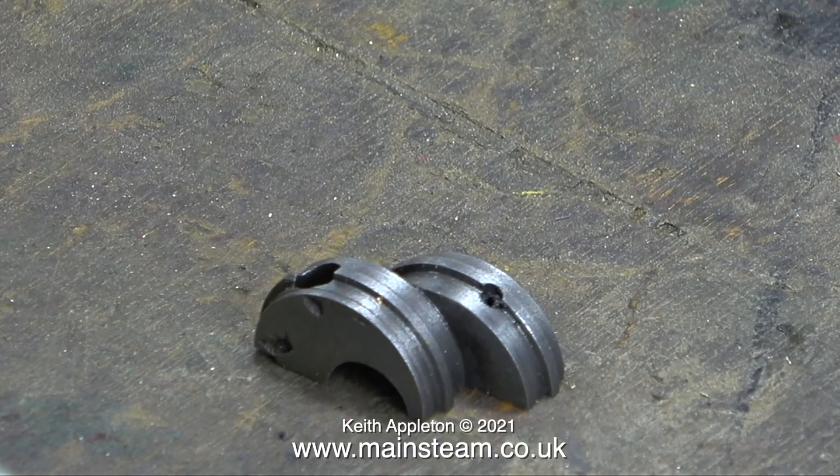In this clip you can see on the eccentric sheaves — which are made from cast iron — some blow holes on one side. This is actually doing me a favour because it immediately tells me which way round the eccentric sheaves are. The eccentrics are not all the same: on the high pressure cylinder there's a 30 degree offset, and on the centre and low pressure cylinders there's a 15 degree offset, and all of the offsets need to be in the same direction. All I have to remember is that the marks on the eccentric sheaves go up against the bearing, and that way the orientation will be correct.